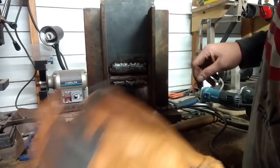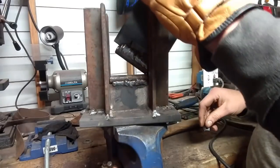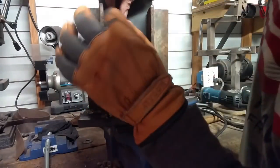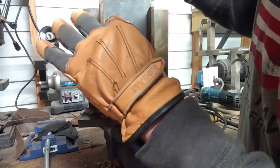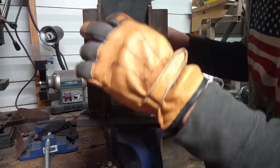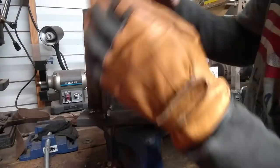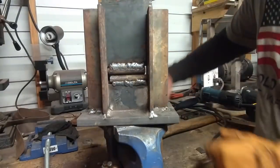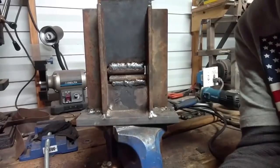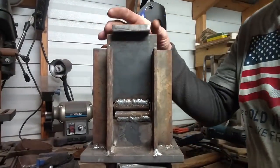This thing stays in place. The bottom one's not so much to worry about — it can't rock sitting flat. The top one's the one that needs tabs so it doesn't rock on us. So we're going to put these tabs on here just inside so it can wiggle, but it will always go back to center. We'll put two on each side, one top and bottom, just to keep this thing stable. And then our striker plate on top — there's the striker plate, just like that.